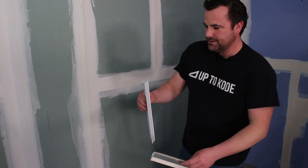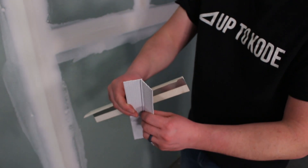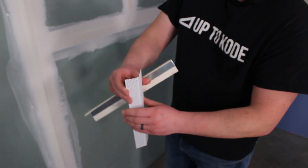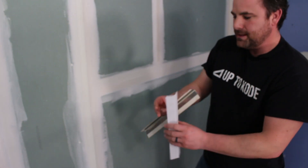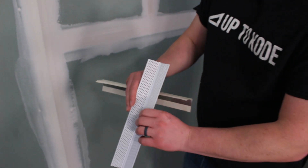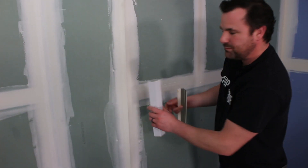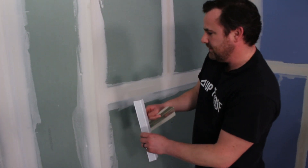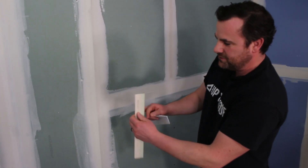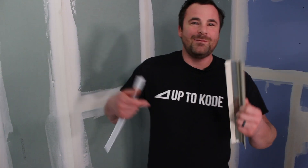Here's a PVC bead for an offset. I don't particularly like the PVC — it has really no flexibility, so you can't adjust if the corner isn't a perfect 45. Plus it's the same issue as the tearaway where you have to contact cement it to the wall. If it doesn't stick perfectly it's just a gong show — you've got to rip it off. I wouldn't use this one. I should have just stuck with my instinct. All you experienced tapers out there, you can bring on the flak — bring it on, I'm used to it.